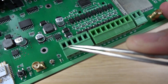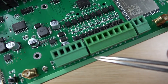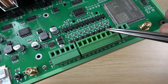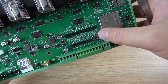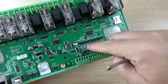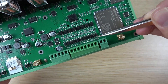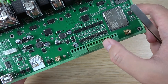Here you can see the DS18B20 temperature sensor interface with VCC, ground, and data pins. There is also an A and B interface for RS485 communication with ground. There are 8 channel digital inputs for manual relay control, along with physical buttons to easily test and control each relay. LED indicators light up when a button is pressed. For external switch buttons such as wall switches, just connect them to the digital input terminals.